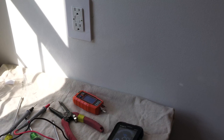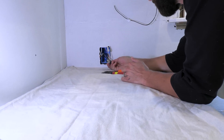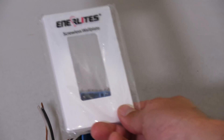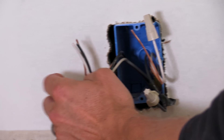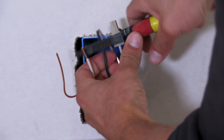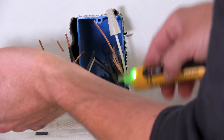We're going to do one more GFCI with load side — check it out. If you want much more details on GFCI, check out our video. On the rough-in we marked our line side conductors with a piece of black tape and capped them off because that breaker had landed, just in case it went live — someone flipping through circuits trying to find something. I'm not going to unpackage my screwless plate because this location gets a backsplash, so that's going to be stashed in the kitchen drawer for the homeowner or contractor later. Use your 12 gauge strip hole — three quarters of an inch — or follow the strip gauge on your GFCI. Check and make sure this circuit is in fact de-energized.